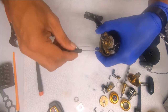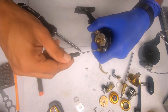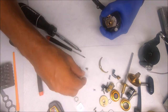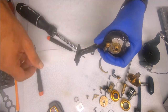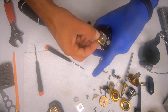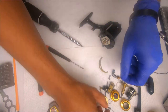The screw for the transfer lever is smaller threading or smaller size than the two dogs. On this dog there's a spring which creates the click mechanism — the click sound that you hear when you engage it. This is the silent dog, which works as a dog that doesn't have any sound when it's active.